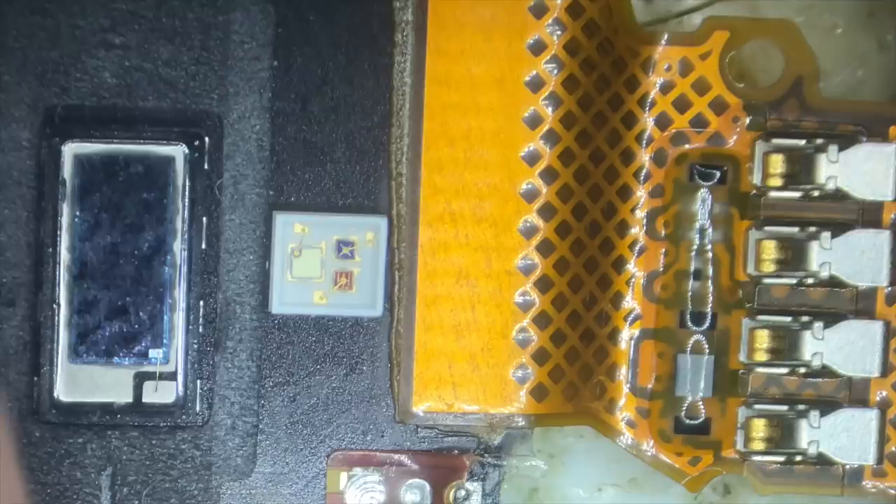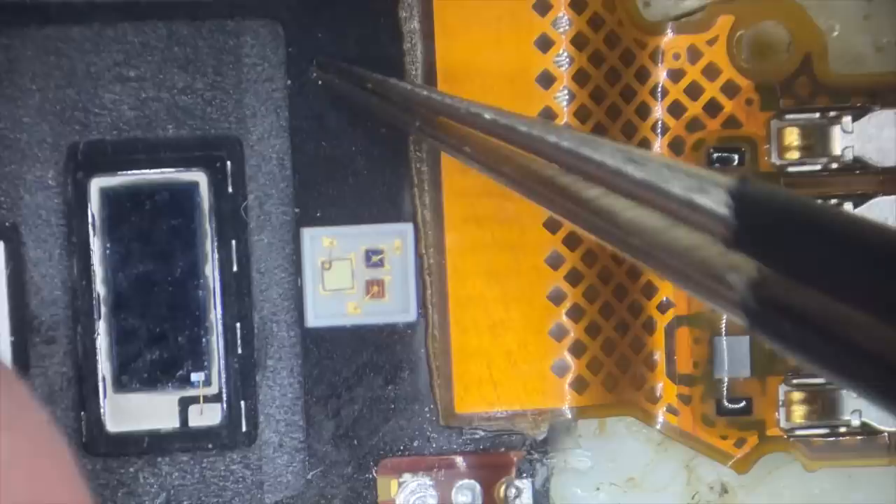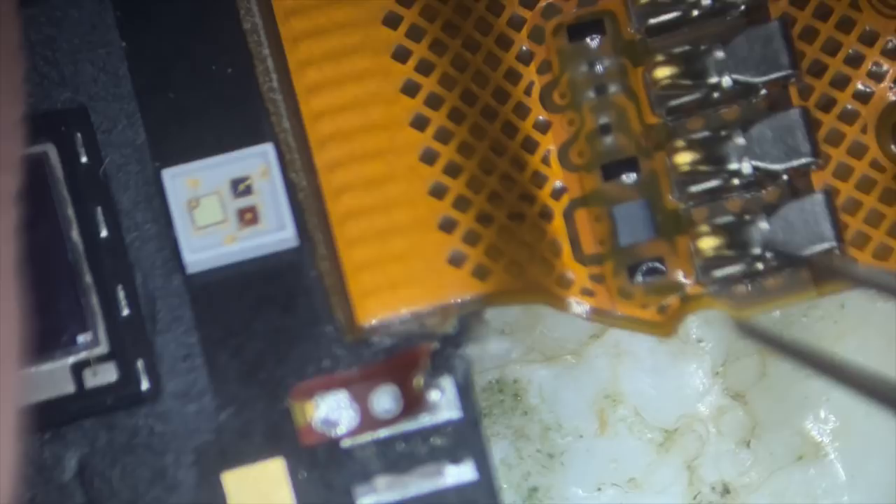What's cool is that this is what's called a rigid-flex circuit board, which makes a really tight integration between a rigid PCB and a flexible PCB. And you can see they've got these custom stiffeners on there that are actually contoured in 3D to make it fit inside of the enclosure and wrap around the side — it's actually a physically shaped thing.